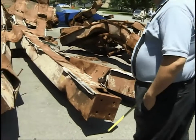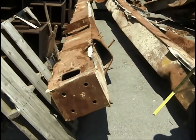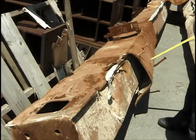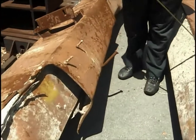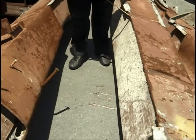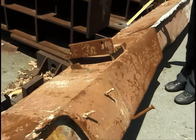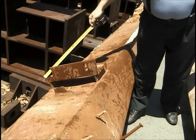This is the top of column one. The end plate welds are intact. There is a little bit of collapse of the box. Spandrel number one, the top one, has broken loose from the center column — not along the bolts, it's fractured. The step is intact. I believe we took a sample over here.